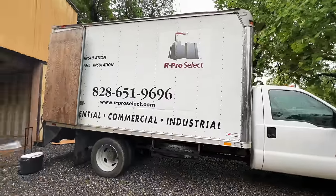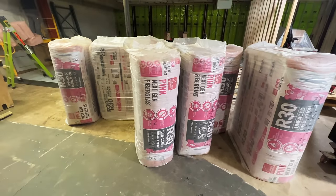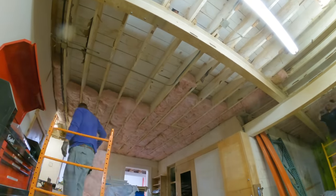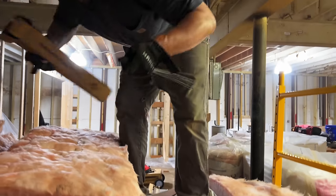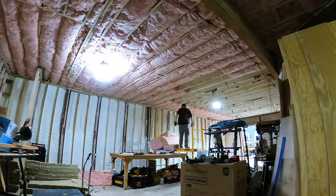The next big step in the shop renovation was getting the new insulation installed in the walls and ceiling. I went with R-30 insulation in the ceiling, well above the code requirement of R-19 for this area since the shop is considered an attached garage. Eventually I'll insulate the entire attic area as well, so R-30 was probably a little overkill, but worth it since I don't know when I'll have the budget to insulate the huge attic space. The insulation crew started by getting the batts installed in the ceiling — these guys are incredibly fast, and it's the same crew I used at my old shop and in the tiny house. In areas where the layout was off, they used tiger claws to help hold the batts in place.